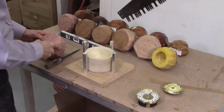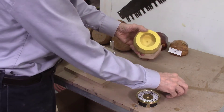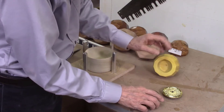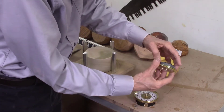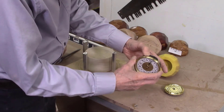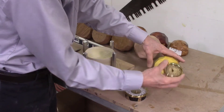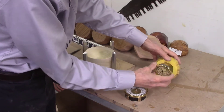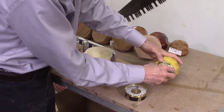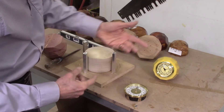The next process is to drill inserts in these faceted blocks to enable me to attach my clock mechanism. The clock inserts come in different sizes — one is 2½ inches in diameter and the larger one is 3¼ inches in diameter for larger blocks. The small blocks take the small insert, and the inserts just slide in — they have a rubber gasket that friction-holds the insert in place. It's that simple to insert, and of course it's battery powered.